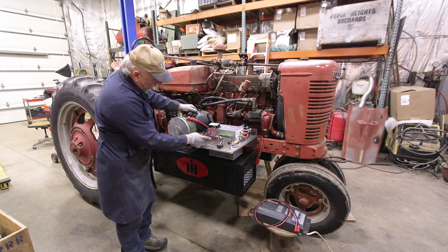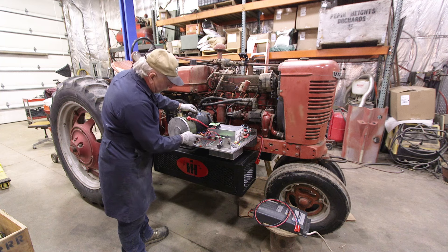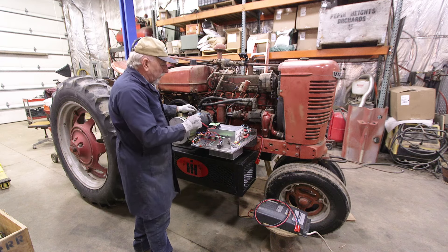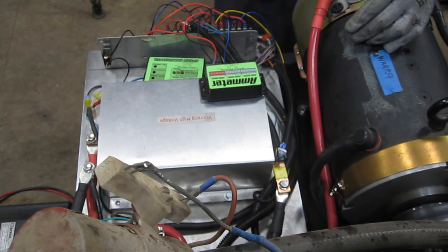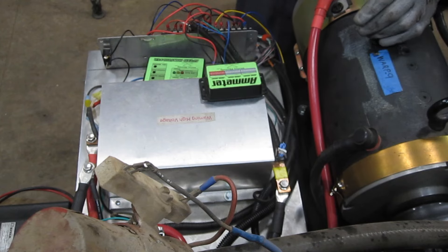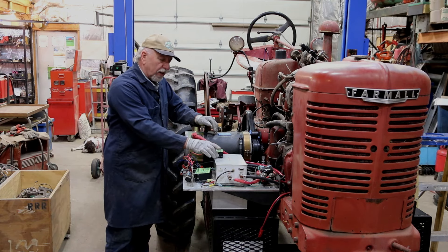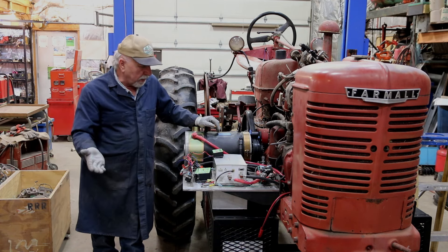We simply put in our circuit board here of terminals, and that's where everything comes in. This is all going to be nicely cleaned up — it's still in its rough stage. Take note over here: we have a current measurement sensor on a little piece of copper that runs out of the motor controller, and that's what gives us the signal for this. It's a real-time reading that we are going to be receiving.